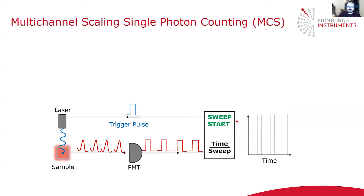The difference is that this time the timing electronics trigger the laser, rather than vice versa as in TCSPC. So the timing electronics send a trigger to the laser, tell it to fire. The laser fires and excites the sample. The sample emits multiple photons, which are detected by the detector and converted into electrical pulses, which are then recorded using the timing electronics.